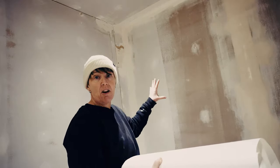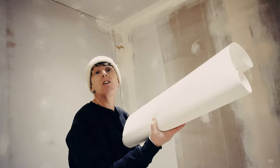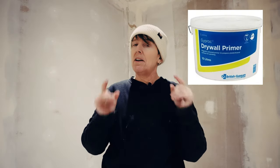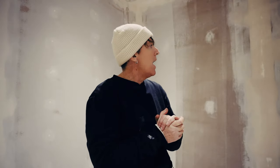It really is a great surface prep for applying wall coverings. There's a whole host of problems that are going to happen if you don't put sealer on the walls. I'm putting sealer purely because I know I'm going to be putting a wall covering on at some point. If you know you're only ever going to paint it, then a drywall primer is going to do a fantastic job.